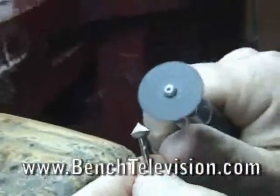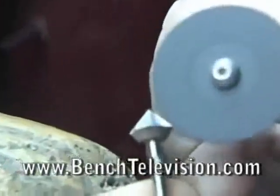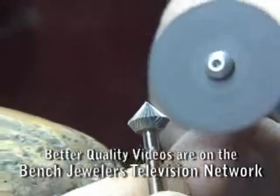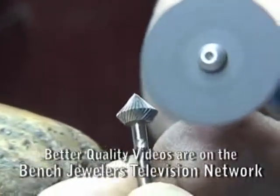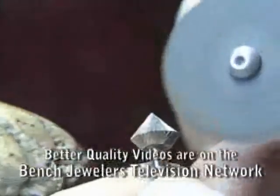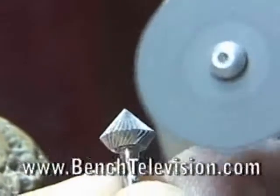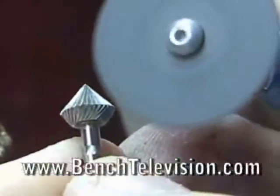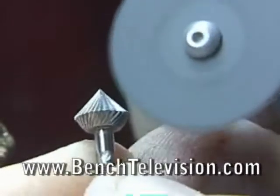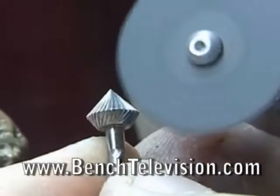What you're going to do is, very carefully, one tooth at a time, go on the edge — it'll take about a minute. What you're doing is grinding on the metal, but you're just going to reduce the size of the drill. Don't worry about that — you're getting a new drill when it's finished. One tooth at a time; it takes a bit of practice.